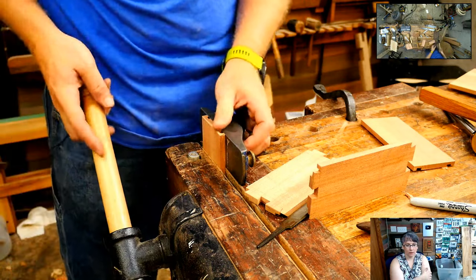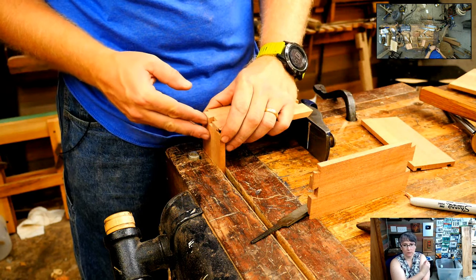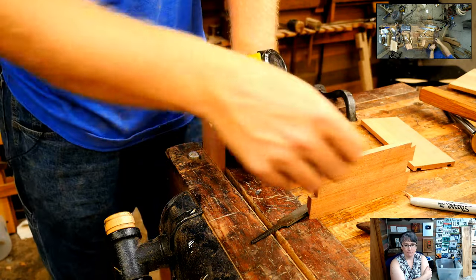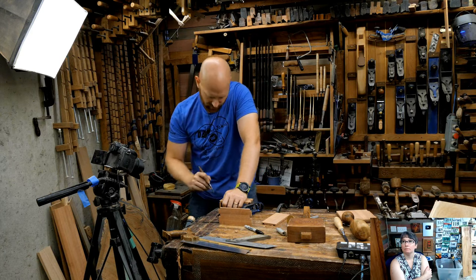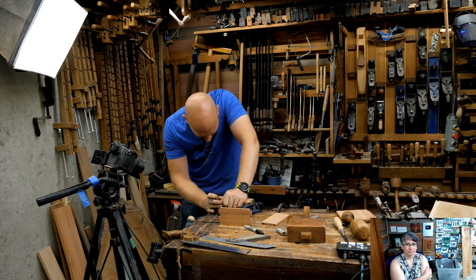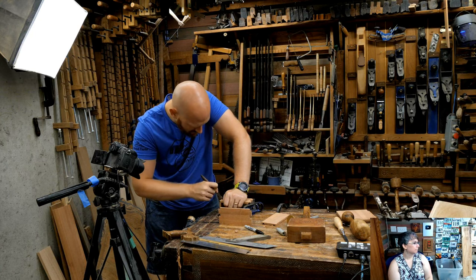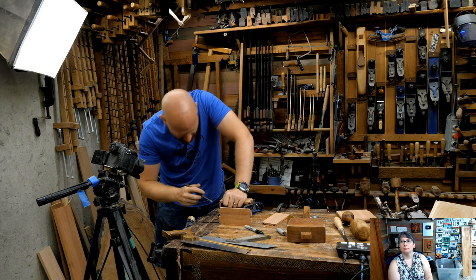So Clark wants to know, what's the longest board you would use a dovetail joint on? I made a bookshelf about 4 feet tall and marking the pins was a legit challenge. You can make it whatever you want. I've never done one that I would say is too long, but I've never done one more than like 26 inches or so. It all depends on how much work you want to do in dovetails. I don't know of a joint that I would do instead of a dovetail that would be easier, because finger joints are actually going to be more difficult, at least in my opinion.